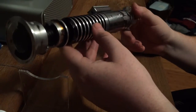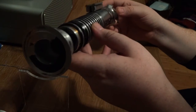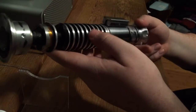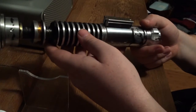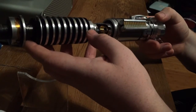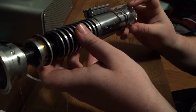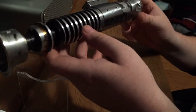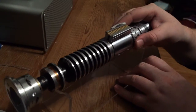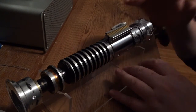It's pretty accurate. You look down the barrel as well — the LED goes in there. It won't be uber bright, but it will still be very bright. The LED engine is going to be wired in series, both the green dies. It opens up really nicely, that spins, that lights up — it's gorgeous. It's got 3D printed parts in there, and it's going to have most likely a Crystal Focus 7 or 7.5 now that they're out. So that's the little update with my Return of the Jedi V2 — I know a lot of you have been wondering what's going on after seeing the pictures and the build thread.